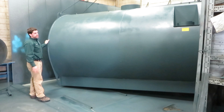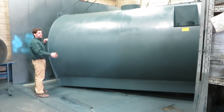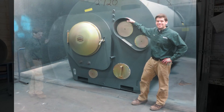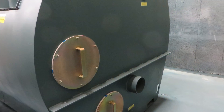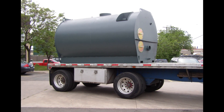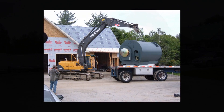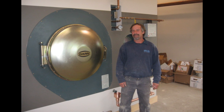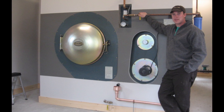That gives you an idea of the size of the unit. It is 12 feet long and about eight feet in diameter, with a net gallonage of 3200 gallons. Flue temperatures are in the range of 250 degrees, which is very good for a wood unit. This is the most efficient unit that we make and definitely the best option for any medium to large commercial application for burning cordwood. If you're considering a large chip, pellet, or cordwood heating system to save money, you need to be considering a Garn 3200. It will beat any other biomass heating system with higher efficiency, greater longevity, and the lowest cost to install and operate for systems ranging from several hundred thousand to several million BTUs an hour.